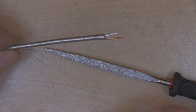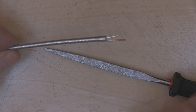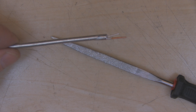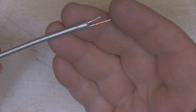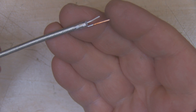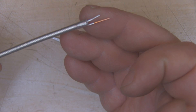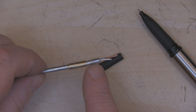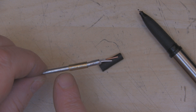I've used the Dremel to grind away any excess solder and round it back off, then used a small file to clean it up so it fits down the balun tube. I've also cut away a small lip of the outer braid to expose about a millimeter of the dielectric for insulation when I bend the signal wire back into an L-shape to solder the element on. Because I've used semi-rigid coax, I'll need heat shrink tubing to insulate the coax so it doesn't contact the balun.